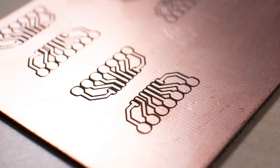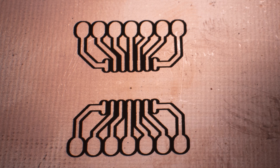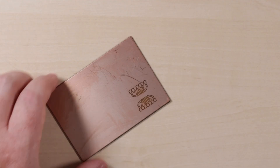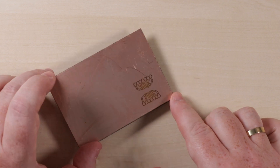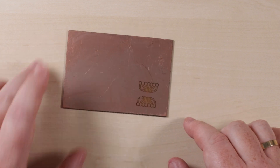We are going to make this PCB today. Unlike with the acrylics, we're not going to cut through the copper of the PCB. This laser can't cut any metals at all. And besides, if the diode of the laser was strong enough, it would also cut deep into, if not straight through, the fiberglass as well.